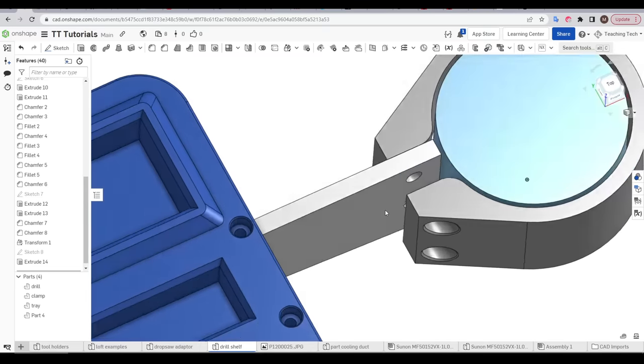We'll explain why I did this in the slicer. The final part of this bracket doesn't need to be anywhere near as strong and its design is quite straightforward — I trace the mounting circles, set up some geometry around them that extends up like fingers, and this will be joined to the rest of the bracket. With the sketch finished, it's a simple matter of selecting our geometry and extruding out 10mm to match the line we drew earlier. I add some small chamfers to help the transition between the two surfaces. My final procedure is to draw the circles where the M4 bolts will interface when they come through from the top shelf. Normally if you were going to tap your own thread the hole size would be 3.5mm, but as we discovered in the last video, if we add 0.4 expanding it to 3.9mm, it will generally end up being perfect. Cut those holes out, and our part is complete and ready to print.